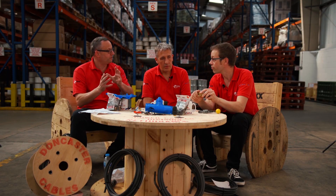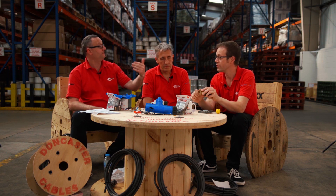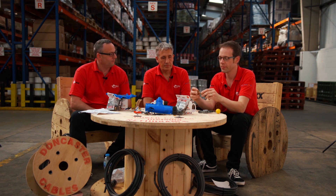So removing the need for that banjo — where we were traditionally coming from the armouring through into an insulated enclosure, you actually get a little fly lead on the outside. That's a really good job. And if anyone watching is a past, present, or future learner of myself or Gary, you'll be staggered to hear us referring to it as a banjo, because of course we specifically call it an earthing ring in college. But while we're here, we can call it a banjo because that's what everyone calls it.